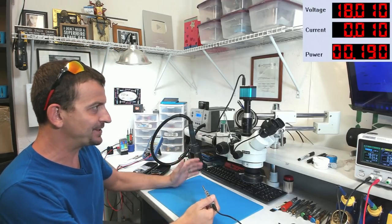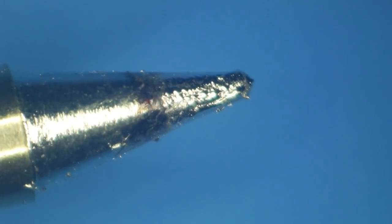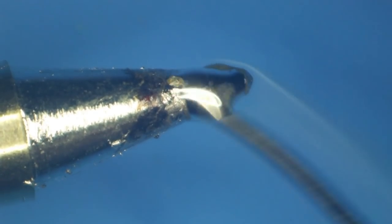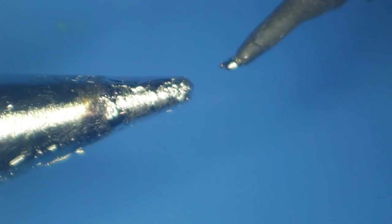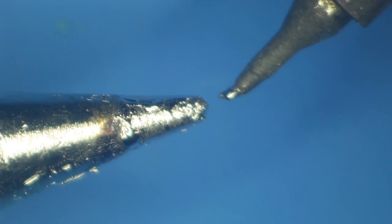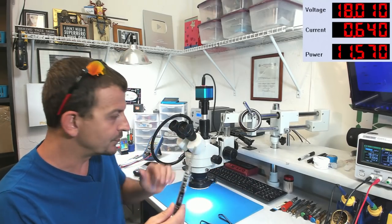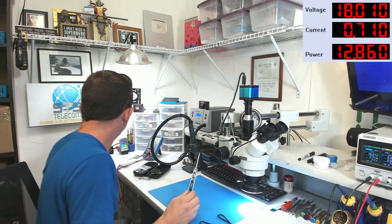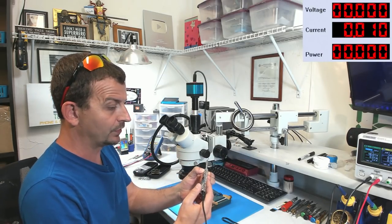Here's a look at that tip under the microscope — I'm going to flood it with some solder. It's significantly larger than what I'm used to working with on this channel. Comparing that tip to my 0.1mm conical micro pencil tip — there's the size difference; they are significantly different in size. So this may not be the ideal tip setup for phone repair. The smallest tip in this style does actually get pretty small, so you can put a significantly smaller tip in this handle.